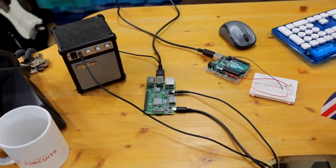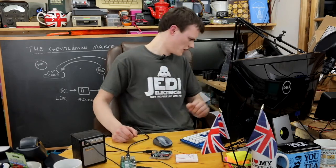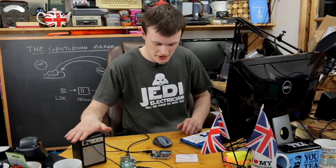Now the first step in testing this is to power up the Pi — which it turns out was powered the whole time. Whoops. I am using my USB port from my computer instead of the USB charger because the charger wasn't powerful enough. This brings up an important point: if you're using a Raspberry Pi 3 and you intend to power it using the micro USB onboard power port, make sure your charger is at least two amp capability — otherwise it's basically going to struggle. So now everything's connected up, the speaker's ready to go, and we're going to log into the Raspberry Pi over SSH to start our Python script.